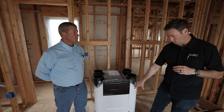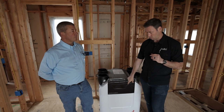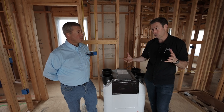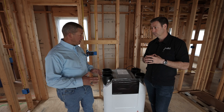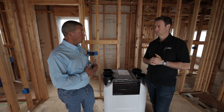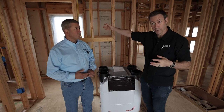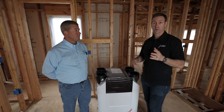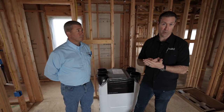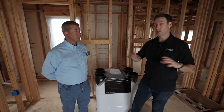And beyond that, the core on this unit, this is an ERV, an energy recovery ventilator. When the streams of air pass near each other in the core here, the outgoing air, the extract air, and the fresh air that's pushing in, this thing is so efficient, it's around, what, 90% efficient or so? For sensible, about 88 to 90, and for latent, about 70 to 75%. Okay. So that average comes out to be about 82, I think, for both latent heat and for sensible heat. And in nerd speak, that means the moisture, meaning it's maybe humid outside today, so we're going to reject some of that humidity. And sensible, meaning just what we feel, what we sense the temperature to be. So it's even more efficient with the heat, basically. And then the moisture, it's slightly less efficient. But this unit is going to be running 24/7, 365. So we can eliminate all those bath fans.